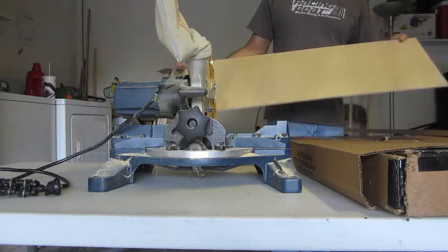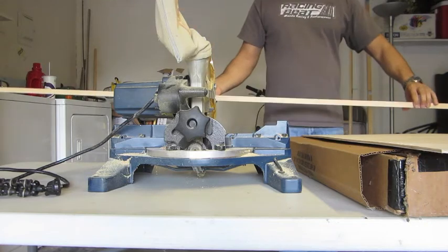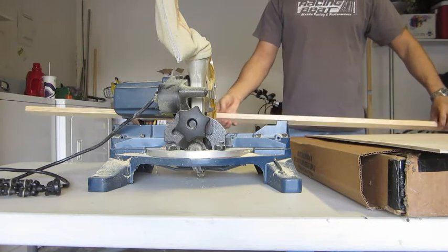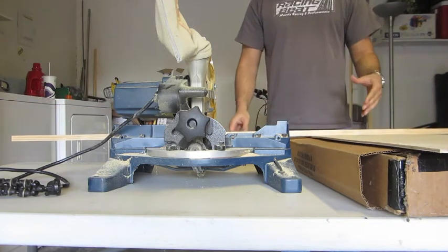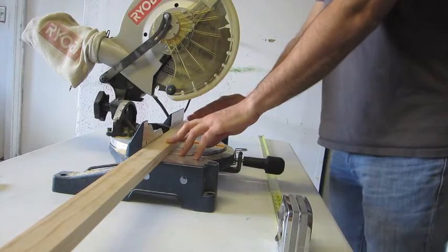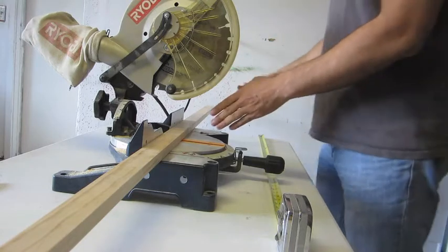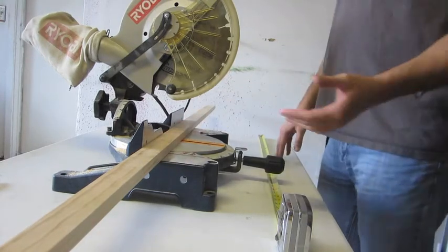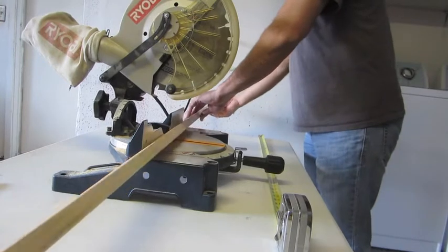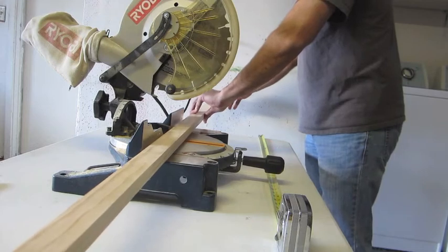I already had it cut down and I'm using 1x2x8 for the sides. The first thing to do is measure this out and cut it down. To make these little pieces of wood easier to manage, before I start doing any angled cuts, I'm just going to break them down into general lengths. The painting itself is going to be 36 inches, but I like to give myself a little bit of extra length so that when I make the 45-degree bevel it's not going to splinter up the edges of the wood.